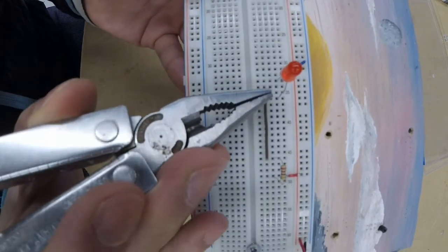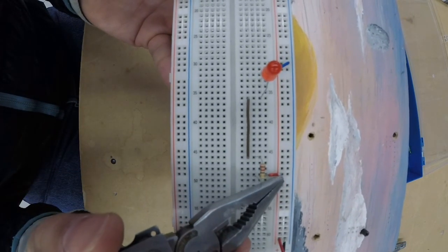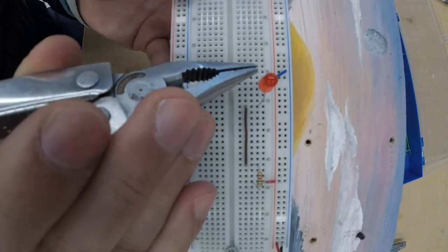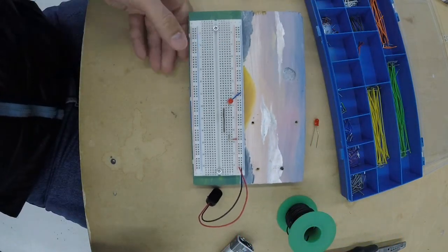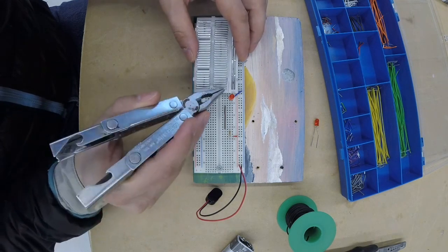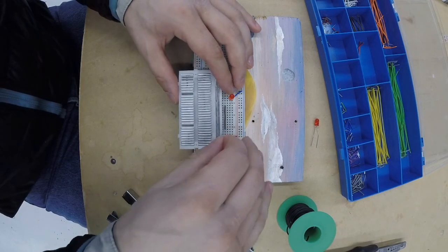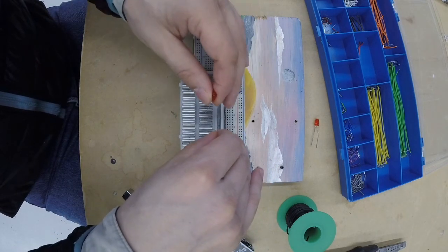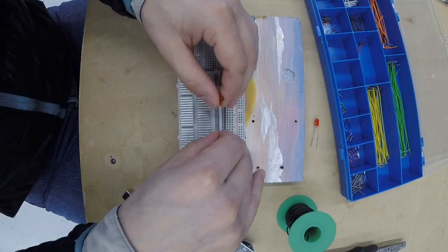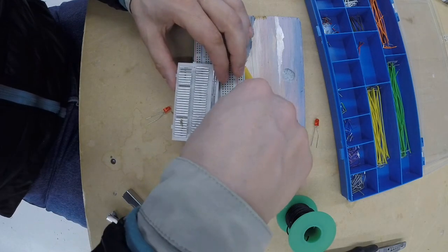Just showing you here how the rows are connected. The legs of the components are all connected in a daisy chain pattern, like arm holding arm, and one leg is connected to the next leg. There is a set of rules you need to follow. As you can see here at the bar, this is the underside of a breadboard, missing a couple of bars, but generally this is what it would look like from underneath if you were able to see it.